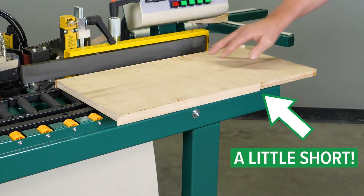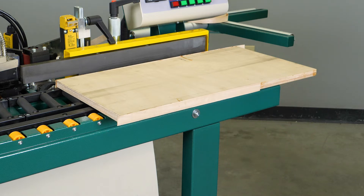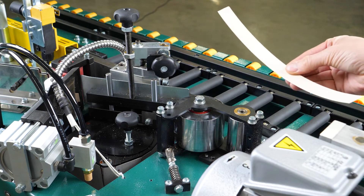So this is obviously a problem, and for this particular problem it wasn't due to the position of our limit switch, but it was due to our edge banding tape from a previous run still in our infeed fence assembly. Always look before you run your board through that your infeed fence assembly is cleared of any edge banding tape from a previous run.